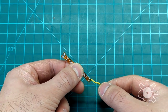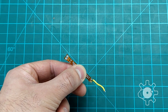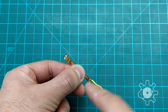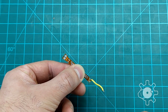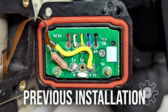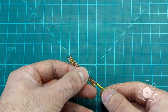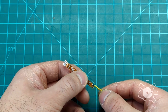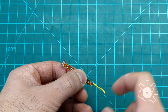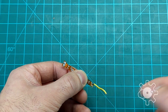The reason why my ribbon cable looks a little messed up is because I had already done the gain mod in a different way previously. What I had done was snipped the ribbon cable and used wires to hook it up to the 1431 board. I found that to work fine, but it ruins your pigtail and it's not as durable because the traces inside the ribbon cable are very thin — if you pull on it a couple times it may snap off.